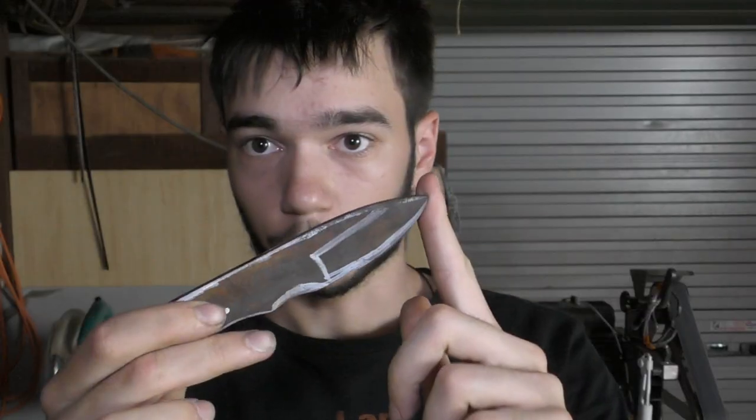We're going to be beveling this little knife — it's a piece of D2, as I used in the first video for the beveling jig. If you haven't seen that video, there'll be a link in either the description or at the end of this video. We're going to drill the holes first and then start taking this down a little bit thinner. We don't want it to be quite as thick as it is currently, which is about five mil. Anything we need to do to the face has to be done first before we start grinding the bevels — it's faster and easier because everything's still parallel.